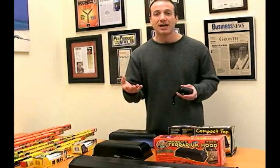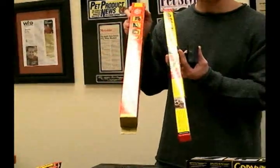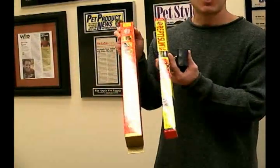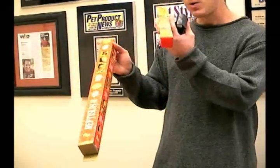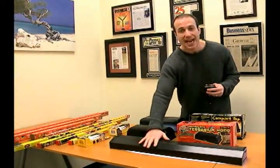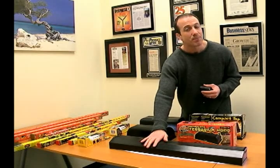Now moving to the linear fluorescent. The 24-inch 5.0 bulb is a thicker diameter — a T12. These 5.0s will probably eventually change to T8 size as well. T8 versus T12 simply refers to the diameter of the bulb; T8s save a little more energy. The 10.0s are already T8 bulbs. So if you don't have a fixture capable of handling a T8, like our smart light fixture, you need to make sure your fluorescent fixture is compatible — otherwise it will not ignite the bulb, and you'll think it's defective, but it's actually your fixture.